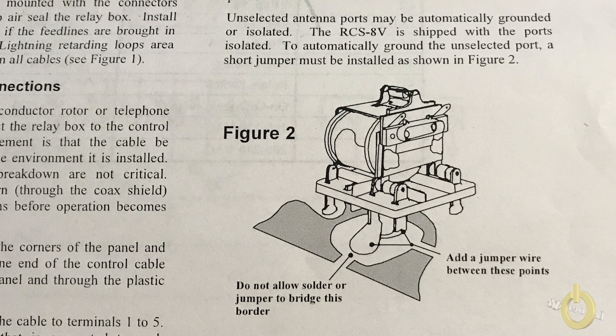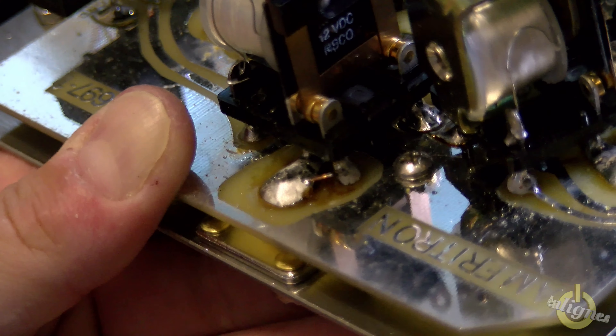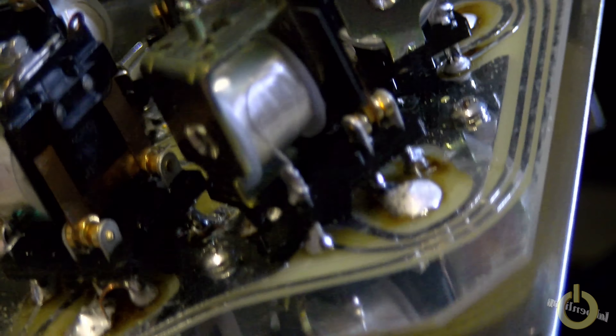This unit, when it comes to you and you're not selecting an antenna, it is open. But in the manual it shows you that if you want it to be grounded on the center pin when not in use, you can do a modification. What you see here is just a little jumper that you connect. It looks like a cold solder joint but it's not — it was done properly. You add this jumper and what it does is, when you're not selecting that antenna, it goes to ground. This is very important to me because it's not a floating wire outside catching RF or whatever since I use high power. I did the modification — it's very simple, and I think it should maybe be the default, but anyway I prefer to put my antenna to ground.